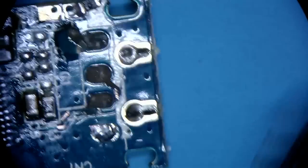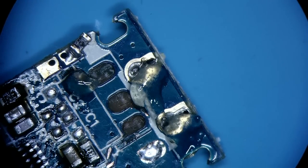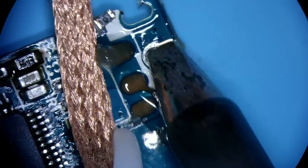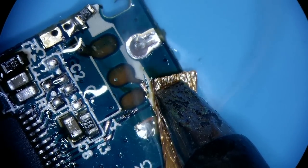So we've got a connector that has these two pins, and the board used to have something in there for them, but not anymore. What can we do? We're gonna make those holes opened up again by using some wick and a tweezer. Fixing somebody's mess, guys, is part of the game. You need to really sometimes get dirty with it, because undoing somebody's failures is usually more challenging than fixing the failures. But hey, somebody has to learn somehow, right?